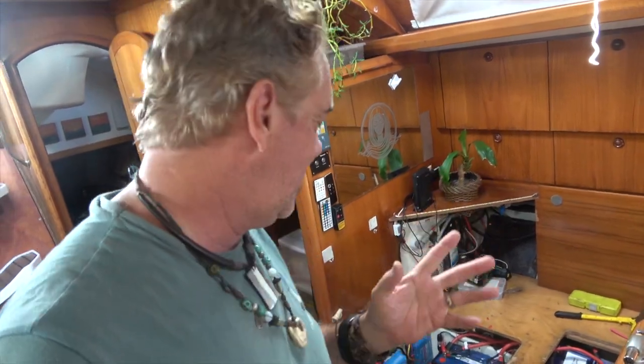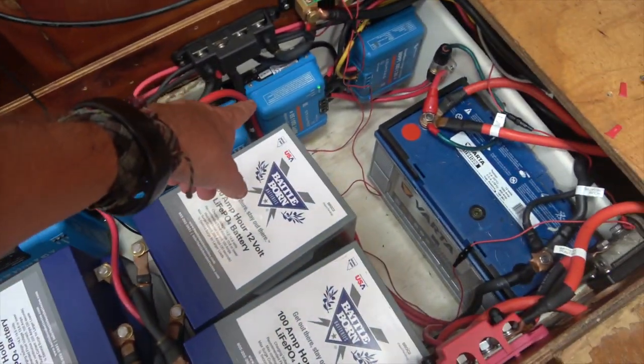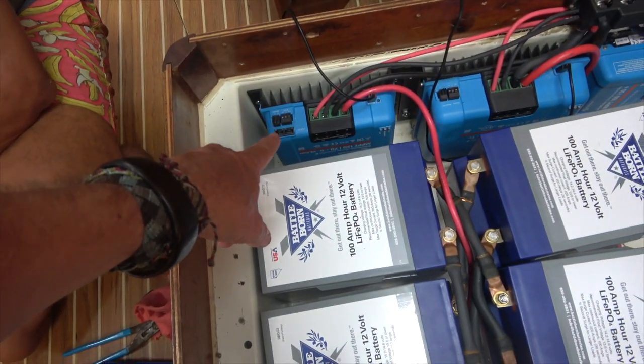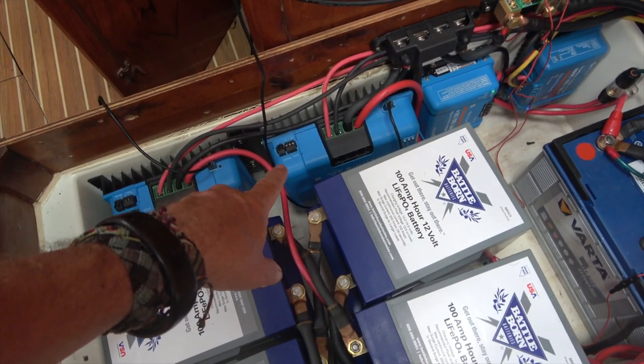So we've got it all hooked up. You can see we've moved all of our charge controllers. So we have our 70 amp, our 100 amp, our 50 amp, and our 30 amp. So the 70 amp is running all the small panels that are on the side rails and on the top of the bimini. The 100 amp is running all the large panels on top of the Dodger and the arch,